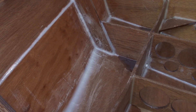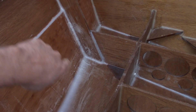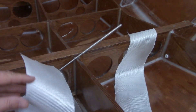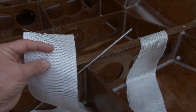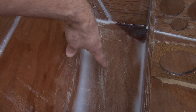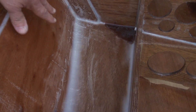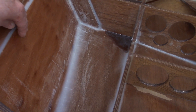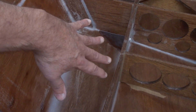So with all that said, let's talk about what I need to get done today. What I still need to get done is all that glass work right here in these corners that I've been talking about — same over here. I've already got these pieces of glass cut and had those edges trimmed off, and I'll talk about why I had to trim these edges in a minute. When I get ready to lay the resin down, I'm not just going to apply resin to the tape area — I need to apply resin to the entire bottom of the compartment and the side right here, and of course that is for waterproofing. I'm only going to take you through one of these; once I do one, you kind of get the idea.